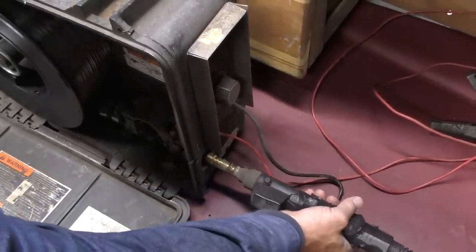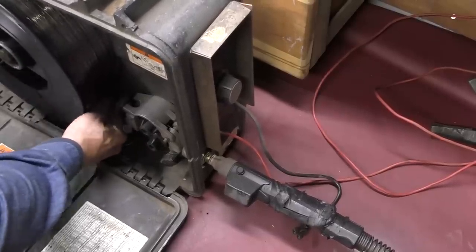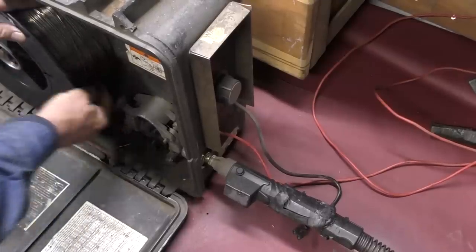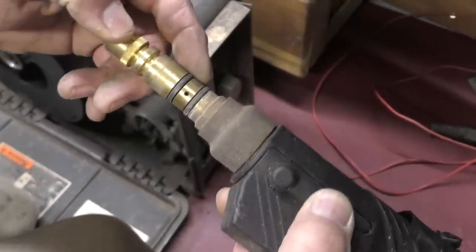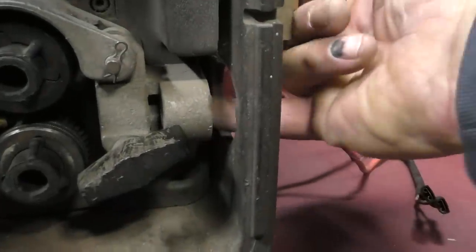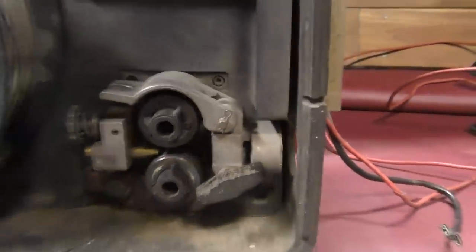I've got the wire in there too already. Draw the wire back. Take the umbilical off — try not to let it spring loose when it comes out. Those little holes are where the gas passes into the umbilical. They all look good. The O-rings are good. This little block of metal feeds gas to it — I can feel a slot in there. Connect it back up, turn it on, put some soapy water in there, and see if it blows bubbles.